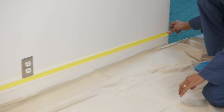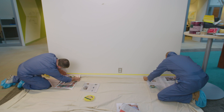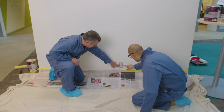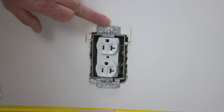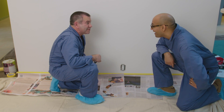Good prep will save you hours of heartache. Mask the areas you don't want painted with painter's tape, which won't damage the walls. Push it down. Now that we've got newspapers down, take the outlet cover off. Instead of having to paint around the cover, you can just paint right over it with the roller, and when it's dry, put the cover back — nobody will know the difference.